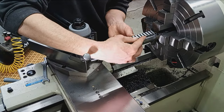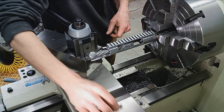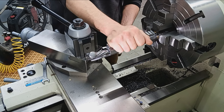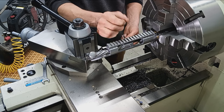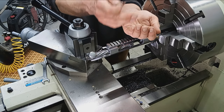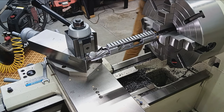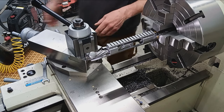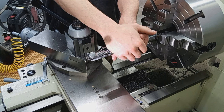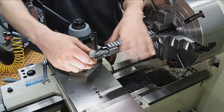Now, if this was a switch barrel of some type that did not require torquing, say a pre-fit for a guy that doesn't have the wrenches and the vices and all that, where it's hand tight and then you cinch it down with a collar, there's nothing wrong with that system. But in that case, I would chamber this a little less. I would want a hard stop on the tape and a drop free on the go gauge naked. I don't do that. Obviously, I have the proper equipment to properly chamber a barrel, by using machine tooling and also the proper wrenches and vices. So, headspace perfect. All the dimensions are hit, accounted for, and achieved.